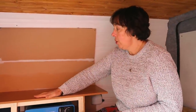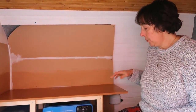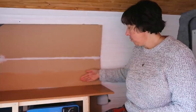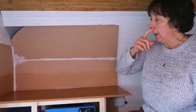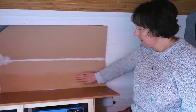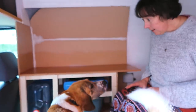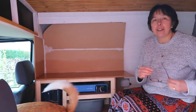The PVA is all dry - it's had two coats, you can see it's a slightly different colour, feels really good and sealed. So we're going to measure out our tiles. It's nice and simple - there'll just be some straight cuts down the back and then a small square in the back corner. All the sharp edges will be tucked away at the back and then covered over with the one line of tiles going along as the splashback. And here's the tile inspector, glasses on so you can see what you're doing.